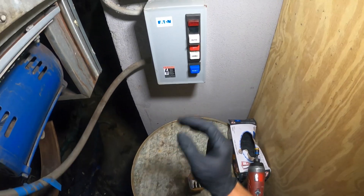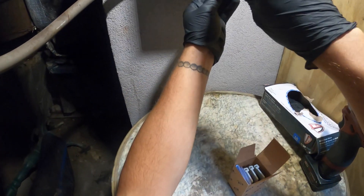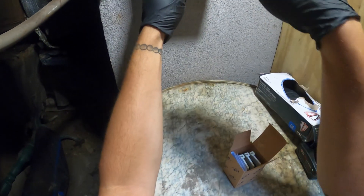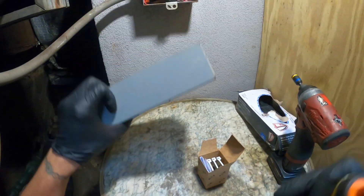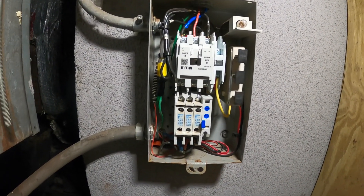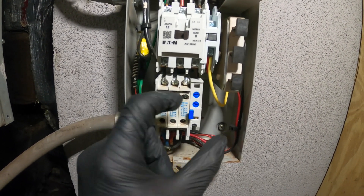Let's turn this off and kill the power. We have a little flat head here — let's loosen that up and open this cover. Here's the motor starter that I changed. It's an exact replacement that came with the contactor and the assembly to hold the heaters, with adjustment.